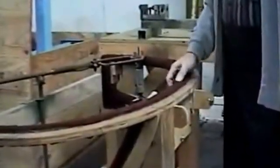I had this built by my master carpenter. The bonded windshield goes in here. The windshield bow is here, supported right here. The glass sticks out, it's uneven, maybe that much, maybe that much. And you cut it off. Here's a fixture with a spring loaded guide because of the different contour. It's upside down now. You've got guides against the bow right here, and you rod it off. You go over it slowly and you go back, it will take off a little bit more, and you have a nice smooth surface for the canopy and windshield seal to match perfectly. Grumman did it by hand, we did it by hand for a while, till I came up with this in '93.